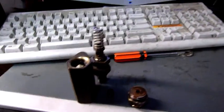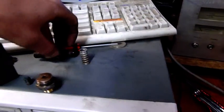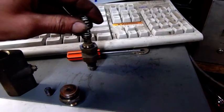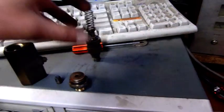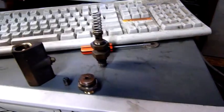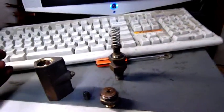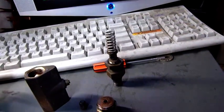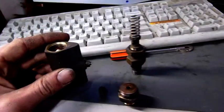Well, I think I found the problem with the gurney. I checked the inlet strainer and everything like that — that's all fine, clean, working. But I took the discharge line off the check valve; that's the return outlet there. I took that off and just ran the pressure cleaner, and it was sticking open. Even when I pulled the trigger on the gun, it was just spraying water out everywhere, and adjusting it didn't change anything.